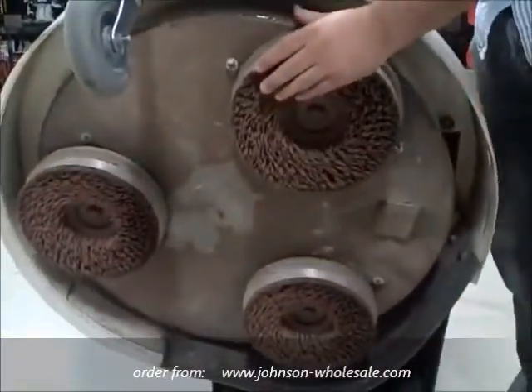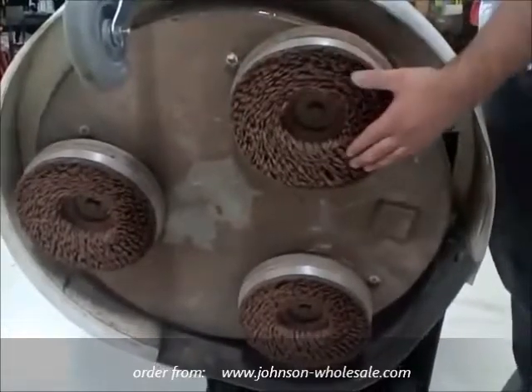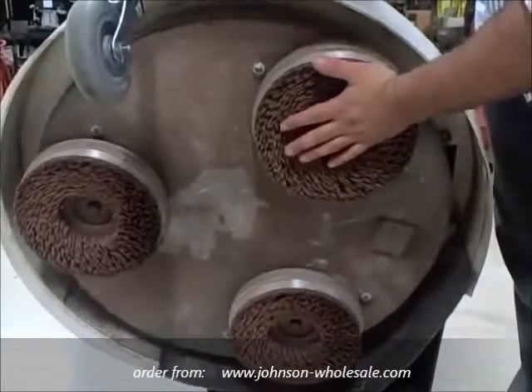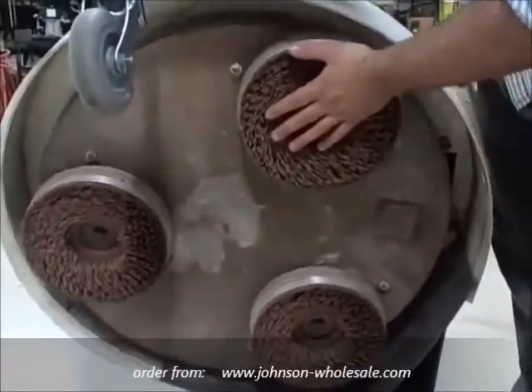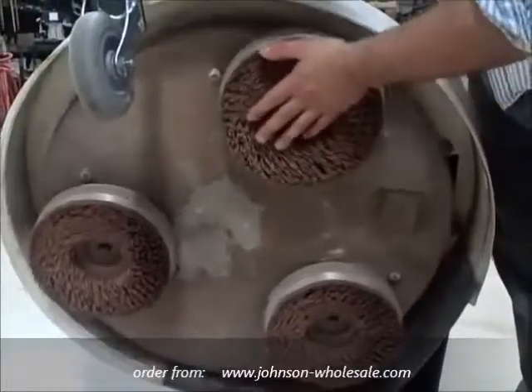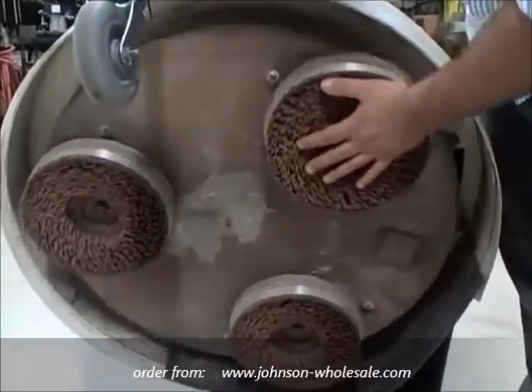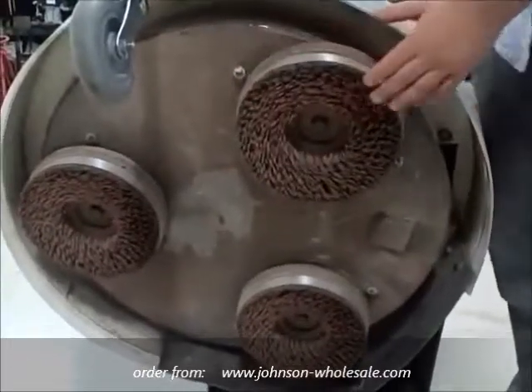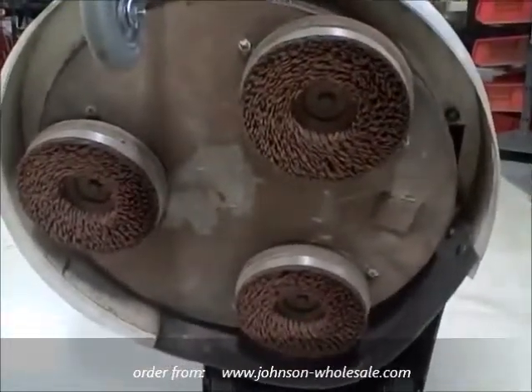What makes the Sidewinder unique and more efficient than other machines on the market is its gimbal drive. As you're doing a VCT floor that's uneven and has dips, the brush drive will free float on the floor, reaching into any dips or divots in the tile. This will eliminate the need for a doodle bug or strip pad later on in the strip job.